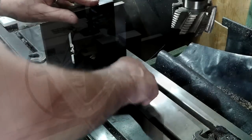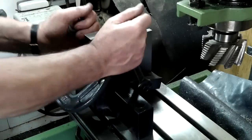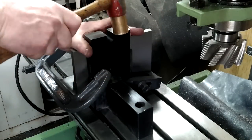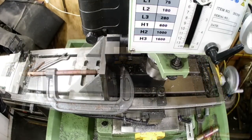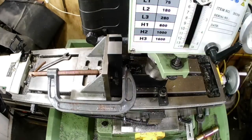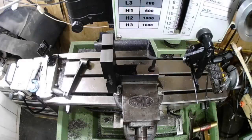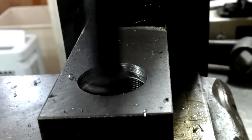Putting the back face flat on the machine table and the bottom face square up against the angle plate, I can now clean up a small area on the thrust face to give spacers and packers a face that won't distort them out of position. Mounting the back face on parallels in a milling vise allows me to finish the 25mm bore using the adjustable boring bar.